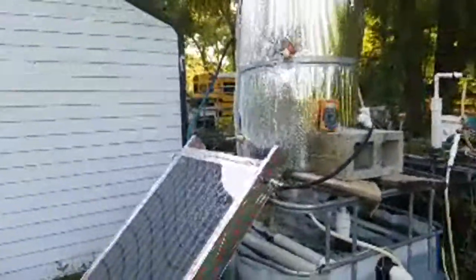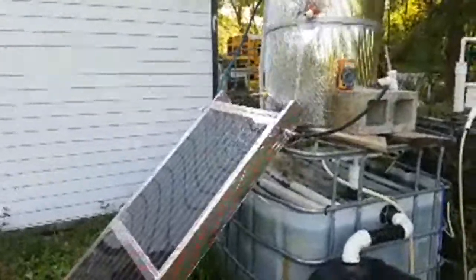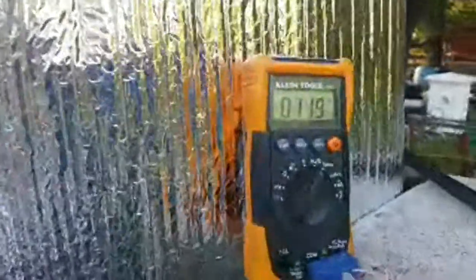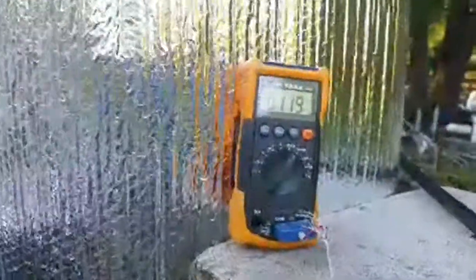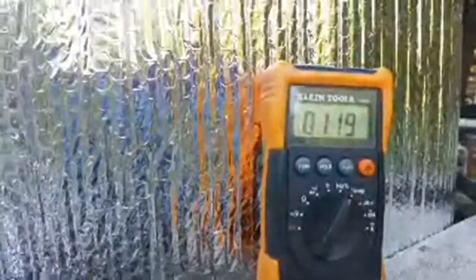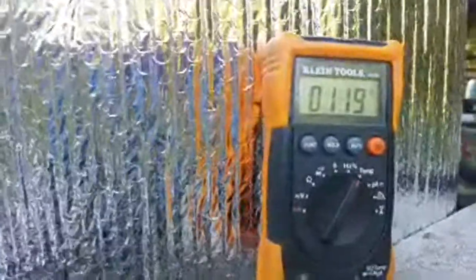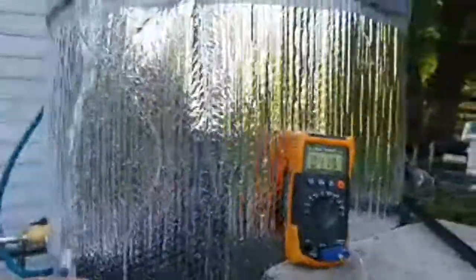So for those of you just joining us, for the last 22 minutes we've been monitoring the hot water output. Oh, look, it went to 119. So we are getting to that little layer of really hot water at the top of that burning layer. I would suspect that since it was 124, for that last layer, it's got to get up to 122 at least. I just want to squeeze a couple more degrees. See, it's about to go to 120.